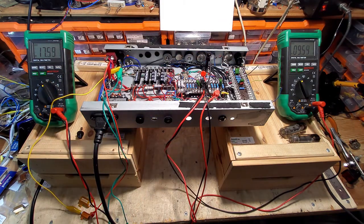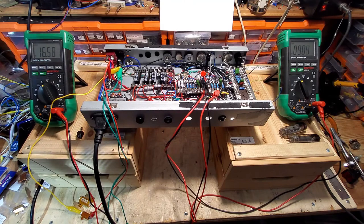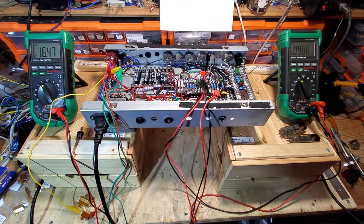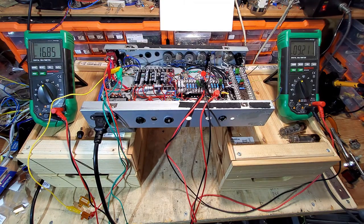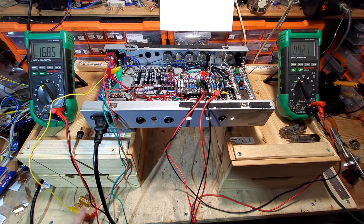So if we drop, going the wrong way. Let's say we drop down to like 232, you can see we're still in even at 230 volts. At 230 volts, that's exactly 16 volts, and if you look at the preamp tubes, they're exactly 9 volts at 230 volts. So we're within 5% generally over that 10 volt margin of 230 to 240. We're well within there. That is exactly how we need to balance these tubes.